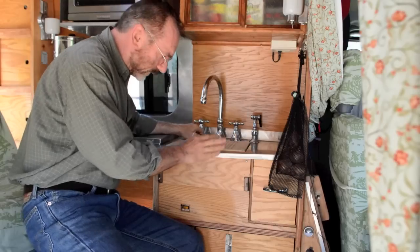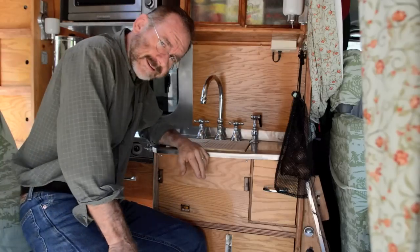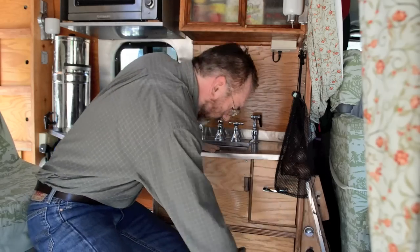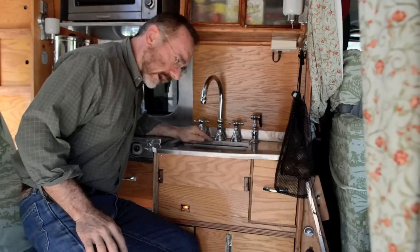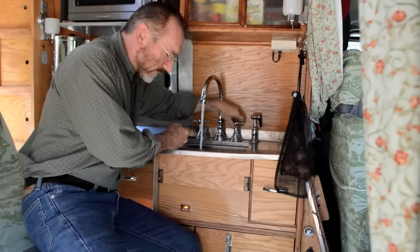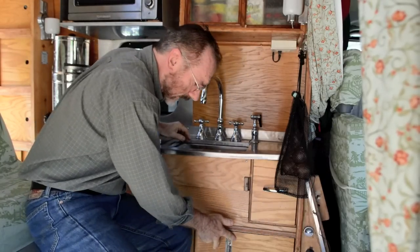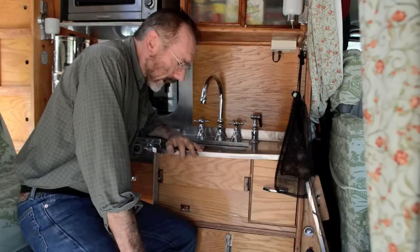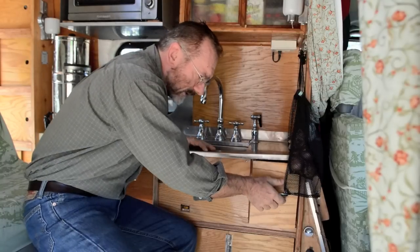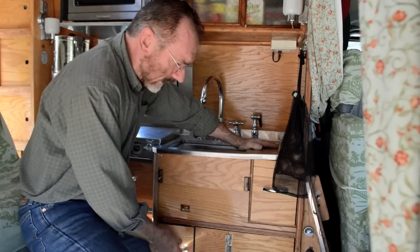This is our full-size sink — notice we have stainless steel here. This was fabricated by Dave Barrett of Plasma Tech; he did a great job. A full-size sink is important because I want to be able to wash my hair in this thing, so lots of water pressure — especially important for your sprayer. The water heater is down here: a two-and-a-half gallon point-of-use water heater — it was the most efficient and compact we could find. Lots of space in here; these drawers go back about a foot.